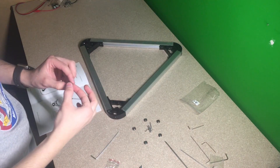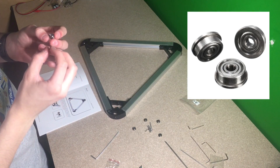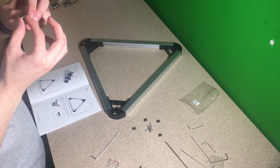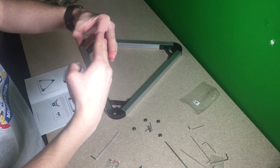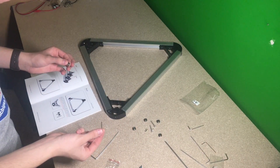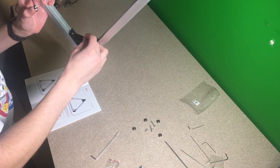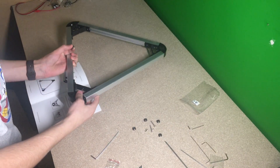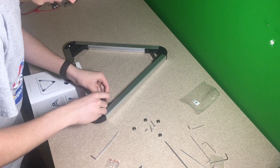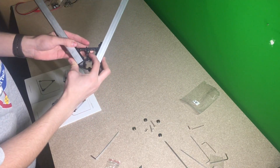Okay, so now we're going to be assembling the belt guide bearings. These are flange bearings, so the flanges should be on the opposite sides of each other — it will be flange, bearing, bearing, flange like that. We're going to be using these long screws. The long screw is going to go through this back hole, through here, and we'll push it through the two bearings like that.